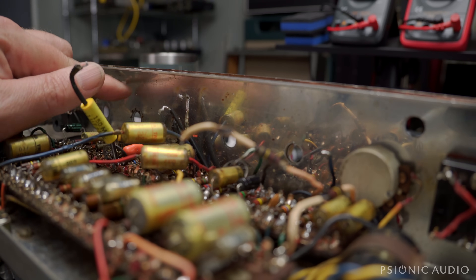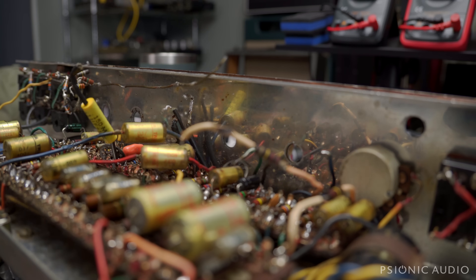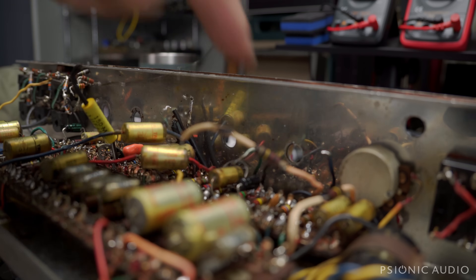I'll remove these three resistors and clean up all the old solder from this bus wire and make it all shiny and new again. This is the beginning of a pretty thorough rebuild to make sure that it never has any issues going forward. A lot of the stuff in this area that's kind of hidden by the pots — now's the time to get all that just right. I'll be going through and checking every resistor and every cap throughout here, making sure they're all good and generating a parts list for the order, because this amp, while it made sound, only made sound some of the time — if you see part one. And that's not good enough.